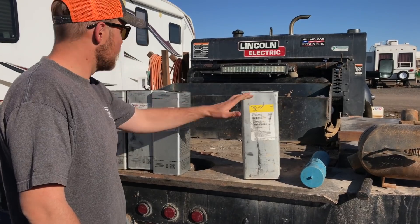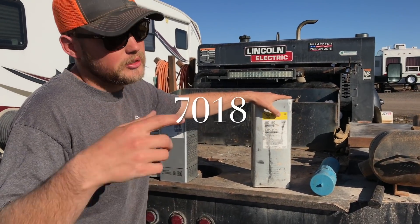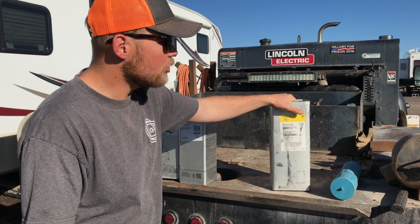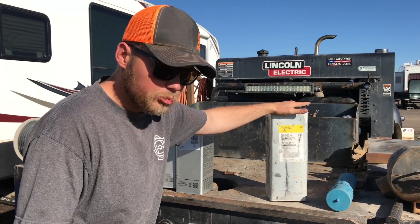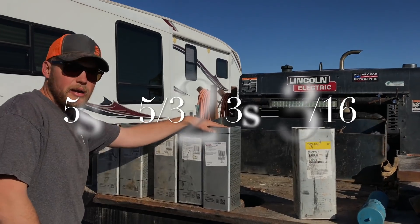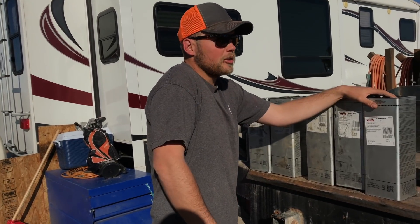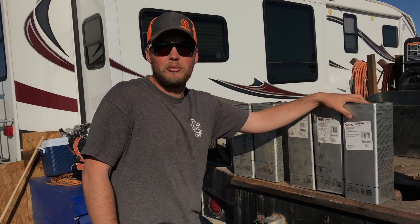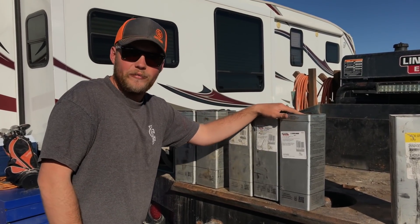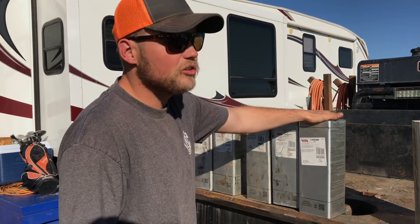So there's your rods, you guys. When you go to get this, probably the best thing — get yourself a box of 3/32 LH to practice your 2 inch and 6 inch. This is all just for practice. When you go out in the field you're going to want some eighth inch. Get yourself a box of 3/32 to practice running pipe so you can get really good at it. Get yourself a box of 5s — if you're just practicing. Get a box of 5s, get a box of 3/16ths. Run the 5s before you play with the 3/16ths.